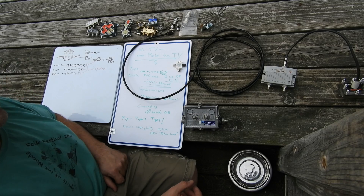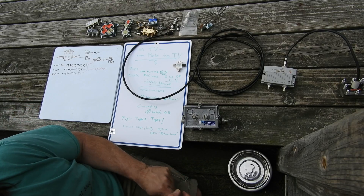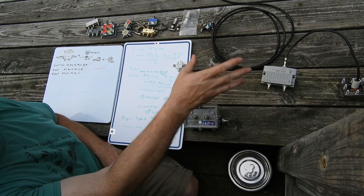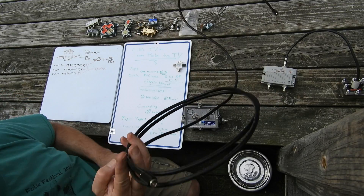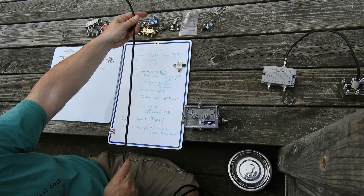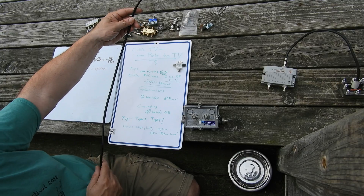I've done a few videos on how cable TV works in broad strokes, so I thought I'd bring it back down to home — what you actually connect to at the pole or the pedestal of your underground cable. First of all, the wire you connect with — coax — doesn't like to have any bends or kinks. It's a transmission line, and a kink will cause reflection.